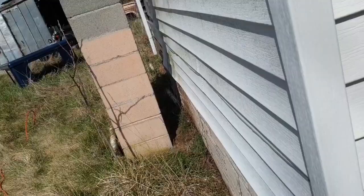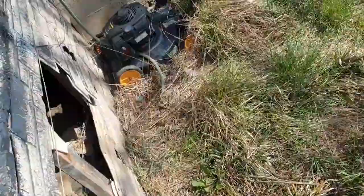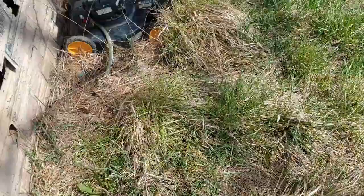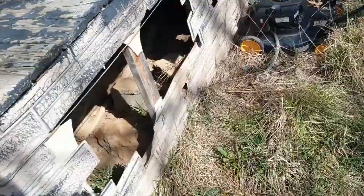That'll have to go back around the other side of the shack and bond with the ground rod at the service entrance on the other side. But then I've got another ground rod to install somewhere, and I'll have to figure out how far away I need to put it from this one.